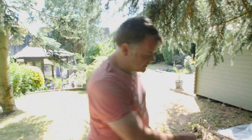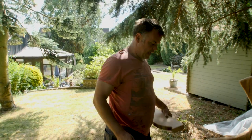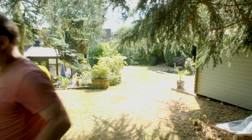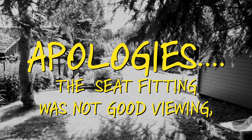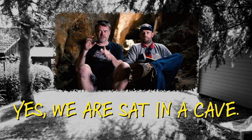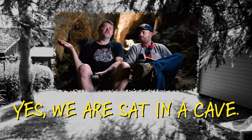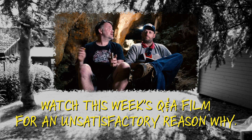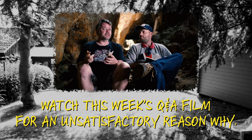I left this tag on because it was very difficult to form it around that end. We also didn't really know where we wanted the seat to come to, so we're just going to whip that off and see if that fits a bit better. When you're working in joinery and trying to get pieces of timber to fit exactly — if you've got a foreman on site pushing you to get the job done, you can't have that level of fit unless it's pure luck. To get pieces of timber to fit like that takes time: offering it up, nibbling a little bit away, offering it up, checking, nibbling away. That's the process to get things to fit absolutely bang on.